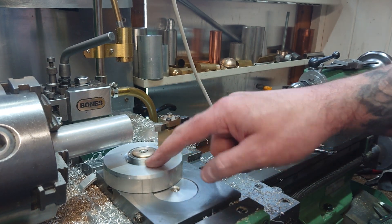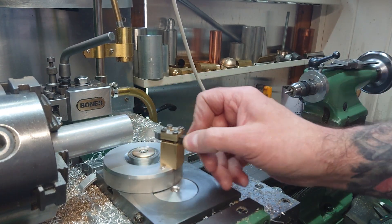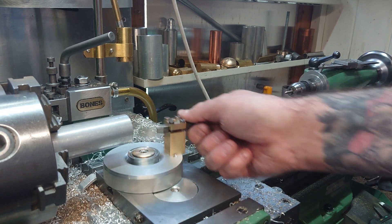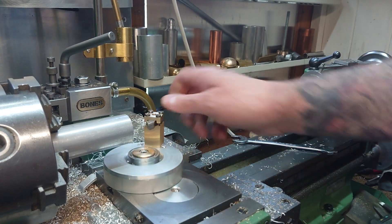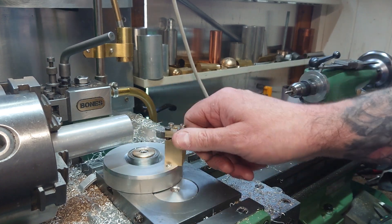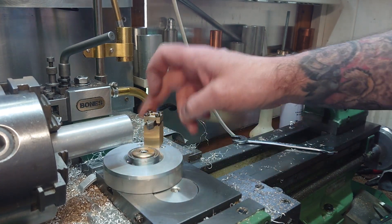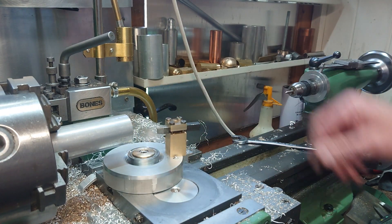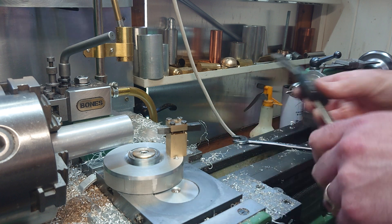Basically I made this a couple of days ago and it's two bearings — there's one underneath and one on the top clamped down. So it moves really smoothly but there's no play in it at all. I'm not really sure what the bearings were to be honest, but you need some big sturdy bearings that are pre-loaded. Anyway it seems to work for me. You can buy these that just run on an oil surface but apparently they grind up a little bit, so I made mine out of two bearings, a bit of aluminium, and obviously the brass here with a channel machined through for the tool piece — I think that's eight mil square.